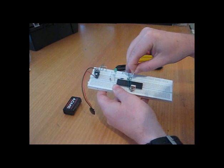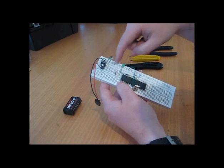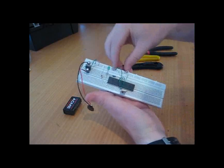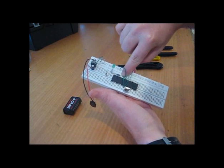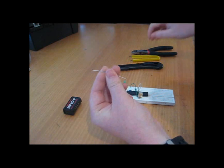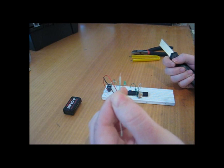I did have an issue with this one — I had to add this earth wire over here, it didn't work, and I found that was the issue. The memory clear is just a 10K resistor going to 5 volts. I've got my oscillator wired up just like in the wiring diagram you can find on my site. I've got my power pins connected to 5 volts and earth. So everything is set up and ready to go. Port B pin zero is the output through that resistor. And just before I test it out, I want to show you a quick easy way to take the insulation off this copper wire — using a Stanley knife, score the wire around the outside and you can just pull it off. There you have the copper exposed, nice and clean.